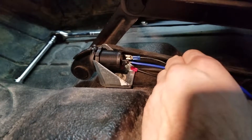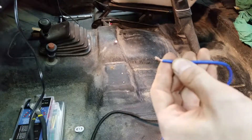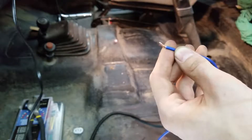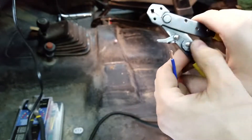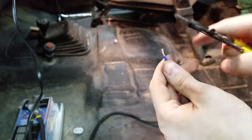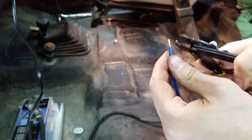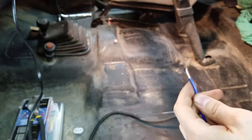The question you're going to have is how do I get power to this? Well, the answer is through a wire. This wire here is not just going to mend itself — you're going to have to put some kind of crimp connector on it. So let's walk through how to do that. First you're going to start by exposing the copper inside the wire, and you do that with a pair of wire strippers. This is a 16 gauge wire, so you're going to want to use the 16 setting. Go ahead and pull that insulation off and throw it in the trash.